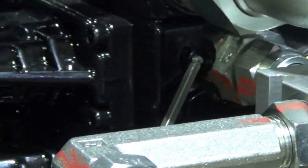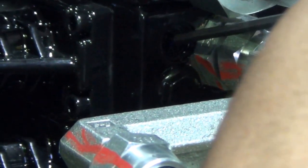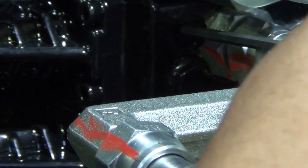He's pointing to it. There will be a little snap ring on there, right behind that, and then you've got a little Allen wrench in there. You can back it out and that will relieve the pressure, and you turn it in to get more pressure.